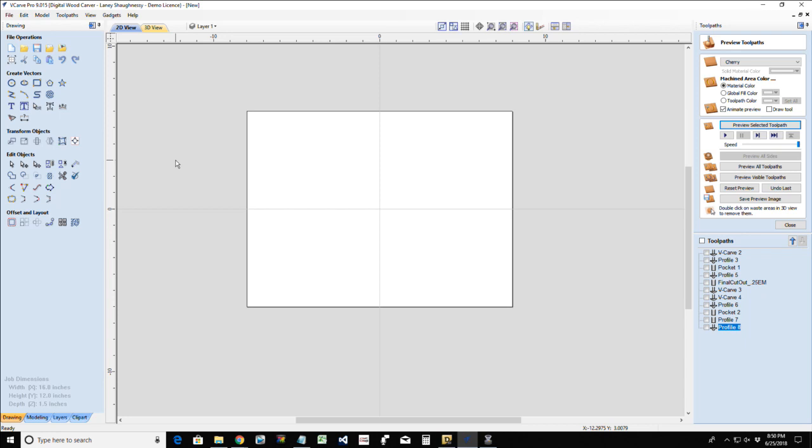start depth 0, cut depth of 0.2 for the female cut. For the male, make sure the design is reversed and there's a boundary around it, with a start depth of 0.1 and a cut depth of 0.1. Those numbers only change if you want a deeper cut for whatever purposes. I'm just giving you some tried and true cuts that have been very satisfactory. The end result has been phenomenal for me.